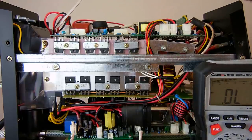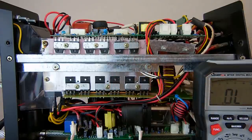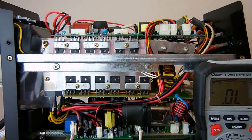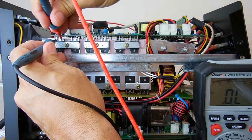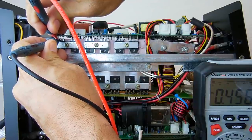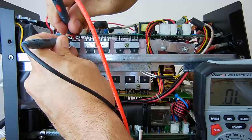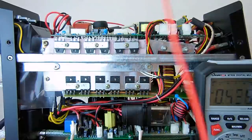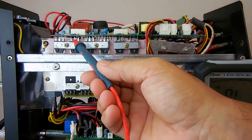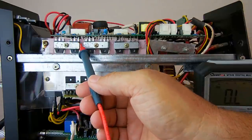The MOSFET configuration is gate, drain, source. There are resistors lined up right over here — each one on the gate. Testing the MOSFETs is fairly easy with them still installed. Check between the drain and source to make sure they're not shorted — on the diode setting you should get nothing, and then around 0.455 the other way. Go all the way down the line. When you test between the gate and drain or gate and source you should not have a short circuit. If you have the meter set to a higher range you may see a reading of 20k to 100k or higher — that's fine, as long as there are no shorts.